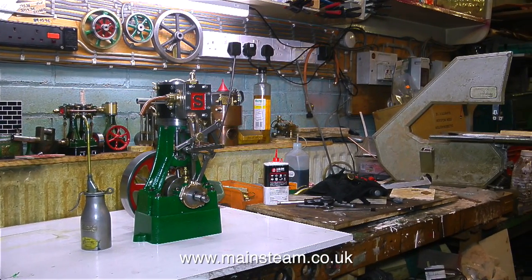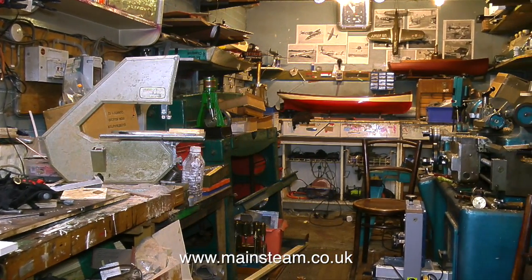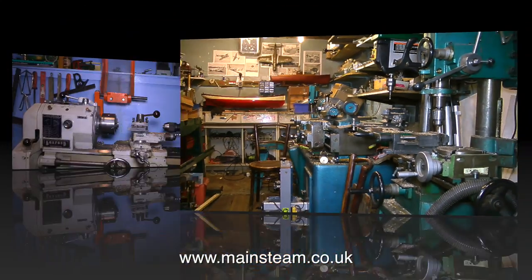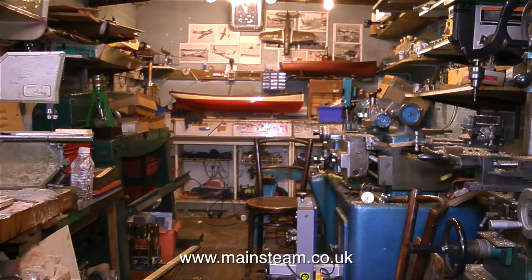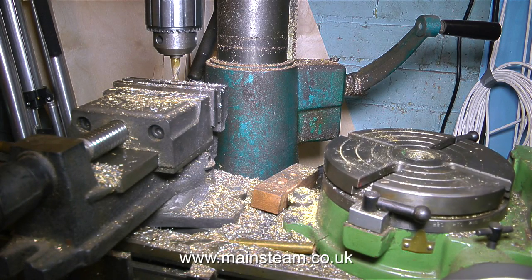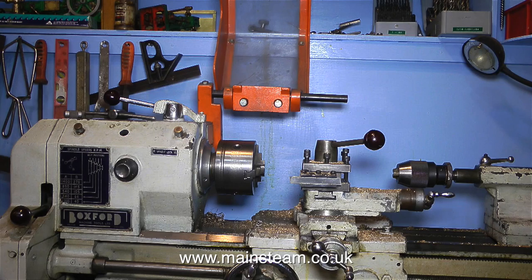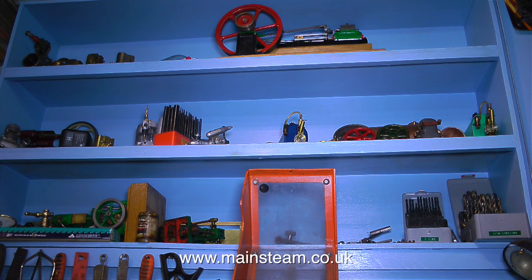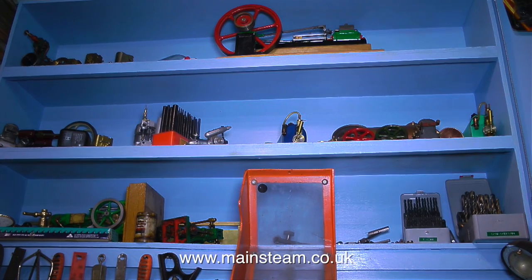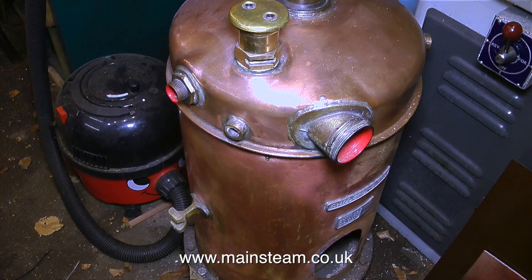By way of a change, I'm going to finish this episode slightly differently. Quite a few viewers have requested a look round the workshop. I'm panning the camera around - it's full of very interesting things, good machines and bad machines. The milling machine's not so good, but the old Boxford's good, and my Smart and Brown 1024 model lathe is very good indeed. Here is my ancient Taiwanese milling machine, which seems to do the trick - my 7¼ inch gauge tank engine was built using it. I use a very old Jacob's chuck for holding the milling cutters - because it's very stiff, they never drop out. I do of course have a Clarkson milling chuck for serious milling. Above the Boxford lathe are shelves with projects yet to start and projects that are finished. And in the corner, looking over everything, is my workshop robot - I call him CNC. One project I really need to finish has been sat here for a while, and I think my Henry vacuum cleaner is trying to mate with it.